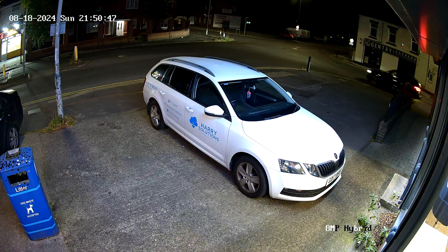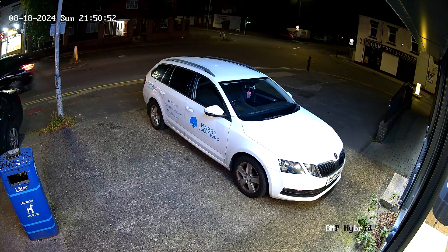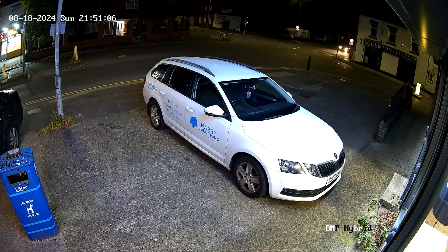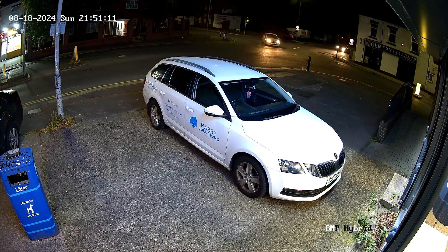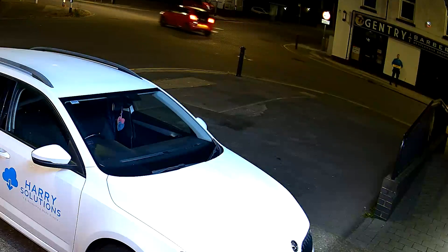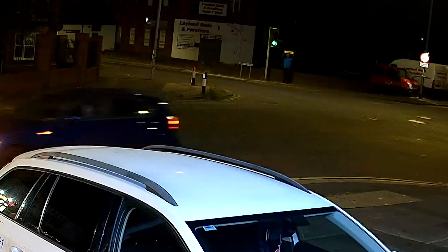Looking at the night footage, you can see the camera has stayed in a full colour image. Everything is just as smooth as it was — we've just lost the ambient daylight around it. The great thing about colour view is that objects are easily identifiable by colour, giving you another dimension to identifying things. So cars that are dark blue are dark blue on colour view, but on infrared cameras just look black. I ran the same test again at night with very similar results — at 15 metres everything's really clear, but at 25 metres it really starts to fall away, and at 45 metres it's barely even recognisable.